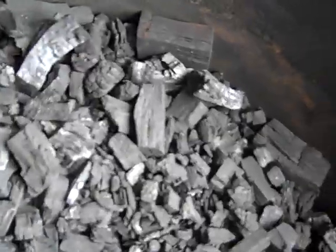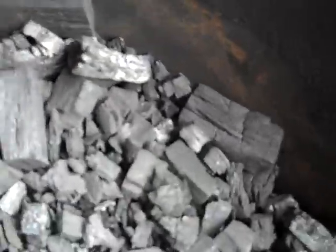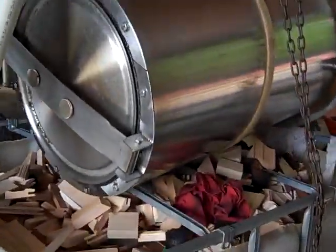Here's my charbed — I've got a lot of chunks in here, more than I thought, that got down past the hearth. That's the grate I'm shaking. I'm looking for some new gasket material before I put this thing back together and I'm cleaning it out. I've got the hopper up here. There's my lead-in cone that comes down into the hearth. I'm just going to clean the heavy carbon off of this. I took all the nozzles out and took everything off with the choke plate.